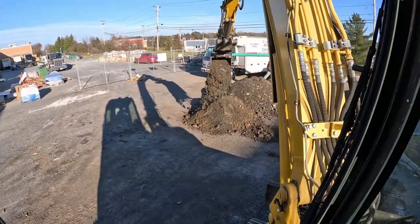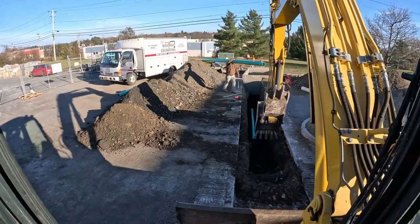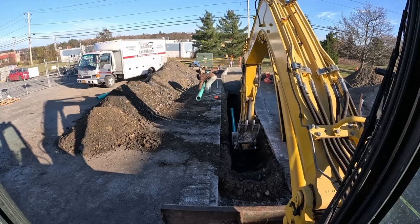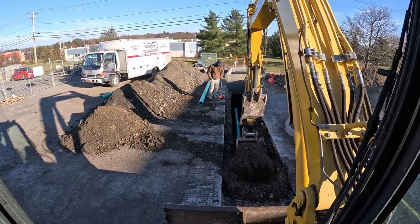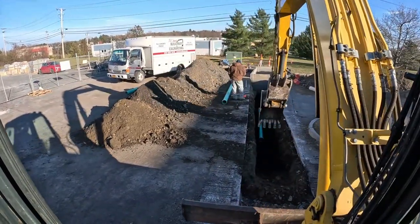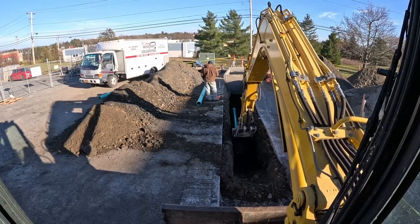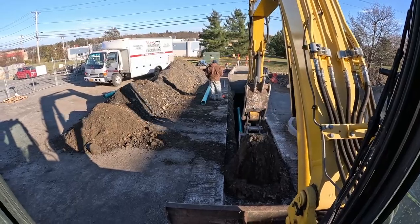You go with the curl, with the teeth coming into it, curling it, good night. So if you run your teeth open, pull your stick back like that, you'll jump up and over before you hurt it, most of the time. We gotta save 54 inches off the blacktop. I already shot grade on this blacktop and it's 3%. We just double checked it with that pipe and it is. So as long as I'm 54 inches deep off that blacktop, follow that.